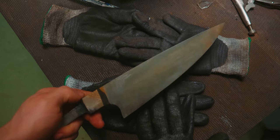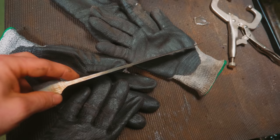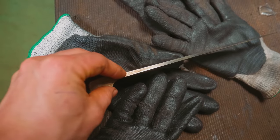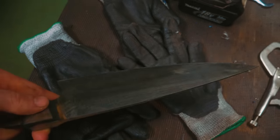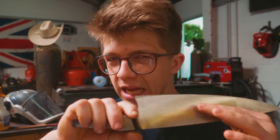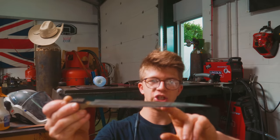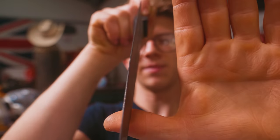We've got some great progress going on; however, that spine is still too thick — still about 30 to 40 thousandths too thick up here, about the right thickness at the base halfway down. We've got lots to do. I am taking my sweet time, trying to get it as even as possible, so every couple of passes I'm looking at it carefully, trying to evaluate whether it's straight and square. It took coming out here, putting it down, taking a second, then looking at it again, to spot that my edge has a warp that goes down and up here.